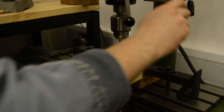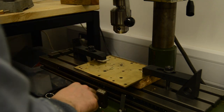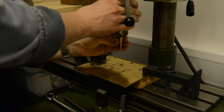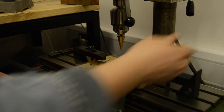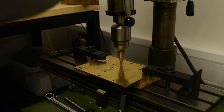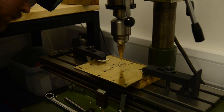With the plate centred up and clamped down onto the milling machine, I then swap the centre point for, in this case, a sheet metal drill, which opens up the hole to a nominal size. I'm not taking much material off — I always like to remove as little material as possible. And it will give me a nice parallel and round hole at a nominal size that I can then make a bush for.